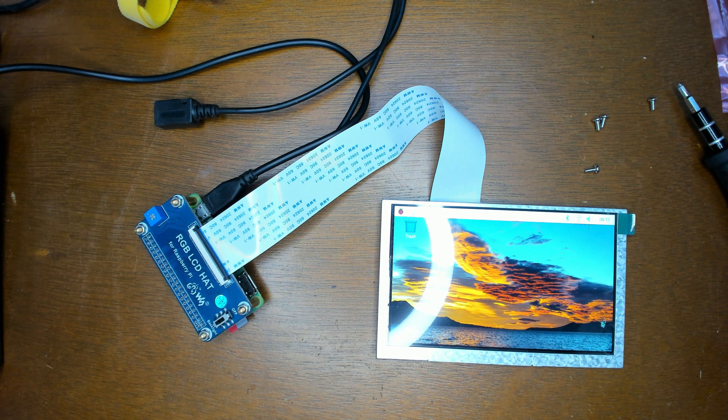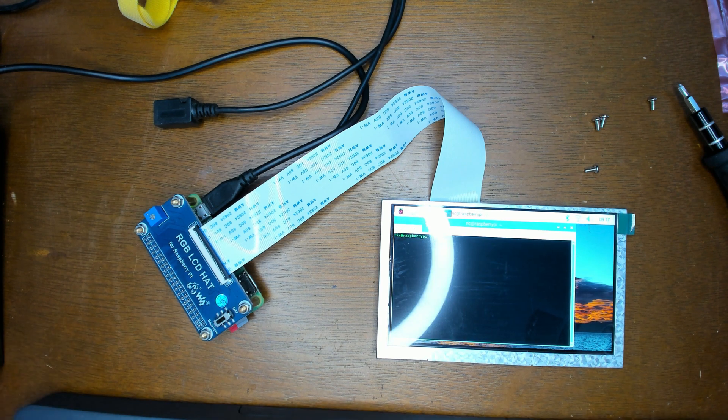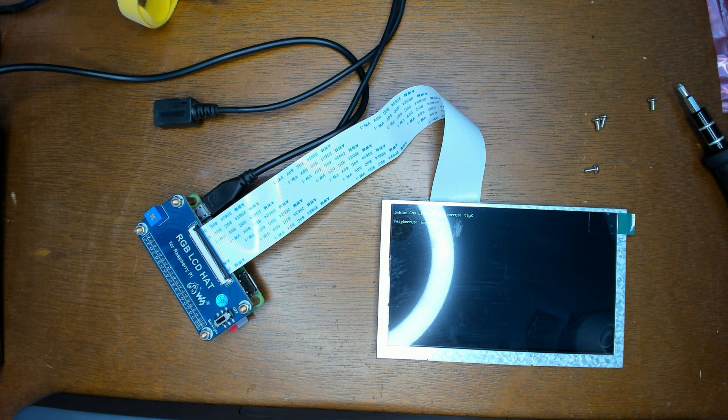With the keyboard connected, as you can see it works. Let's open up a terminal. The good thing is you don't need the GUI — you can go full command line on this display and it works fine. In some SPI situations the drivers are weird and you can't go into complete DRM-only command line mode with fbdev, but here you can.